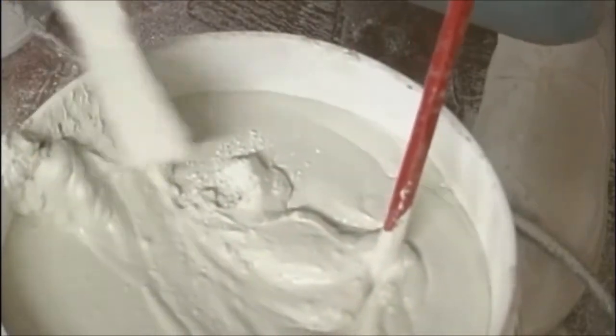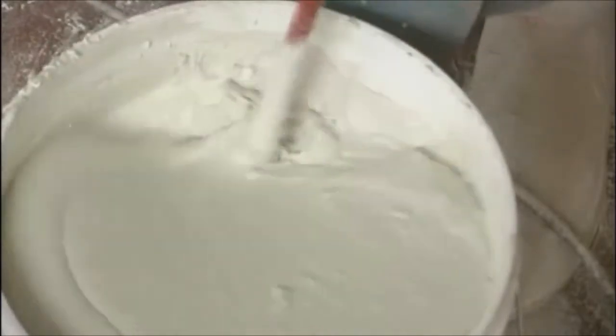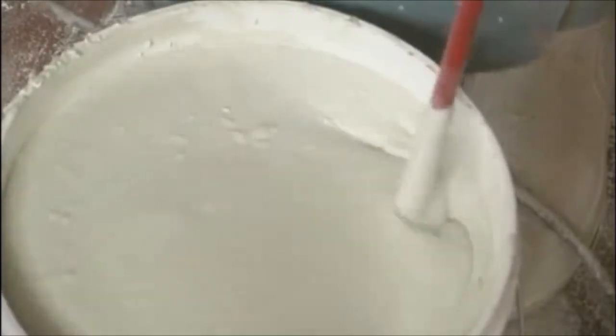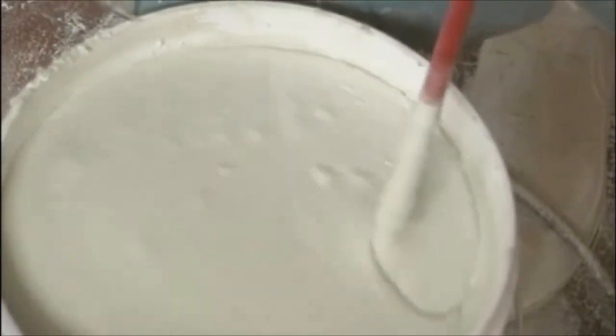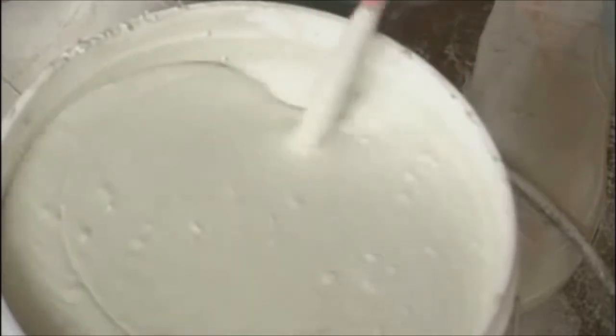After a minute or 2 of mixing, scrape the inner edges of the pail to remove any undissolved material. Mix the plaster at high speed for another several minutes until there are no visible lumps. Never mix with the paddle forcibly scraping the pail. This can result in plastic shavings in the plaster.